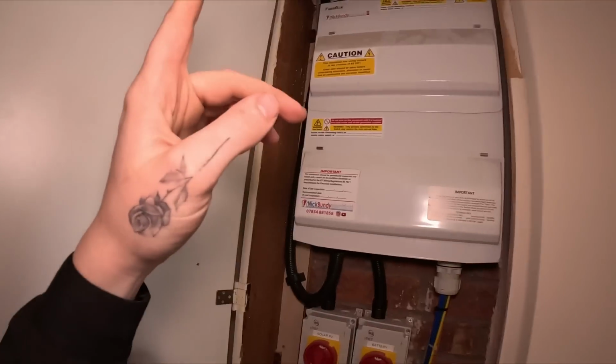Up and across, so we want to turn the lighting circuit off, so you can see the lights behind me. Beautiful. Right, I will get a locking off kit on that, because to be fair, no one can reach that except me, but I will do this on my due diligence, because of the kids in the house and all that sort of stuff. We're all out with electric. You got any tape? Yes. Yeah. I'll get the locking off kit. We'll run the new main upstairs. I'll just show you it's dead, and then I can get on with my stuff.